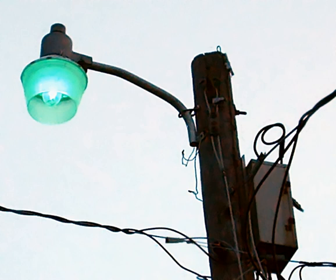If they use a starting electrode, there is always a thermal shorting switch to eliminate any electrical potential between the main electrode and the starting electrode once the lamp is lit. This electrical potential in the presence of the halides can cause the failure of the glass-metal seal. More modern metal halide systems do not use a separate starting electrode; instead, the lamp is started using high-voltage pulses as with high-pressure sodium vapor lamps.